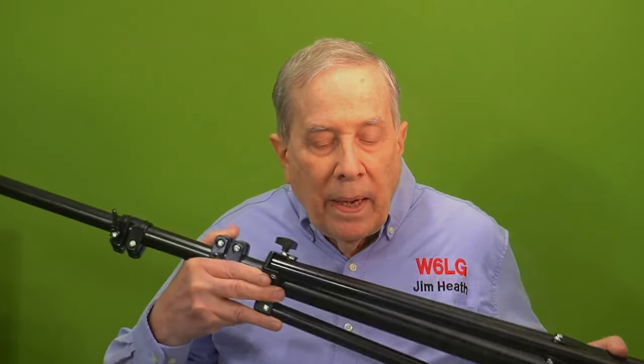So would your neighbors complain if you're in an HOA and you had this in the backyard? I mean, it comes down in a few minutes and goes up quickly. I don't think the neighbor could complain about it — it doesn't look like an antenna, it's a tripod. I think it'll make a fairly decent antenna because the widest part is at the legs, and that's the high-current place on an antenna. Most radiation will occur at the bottom.